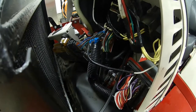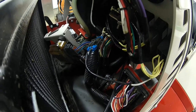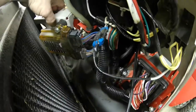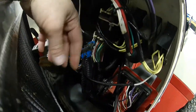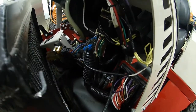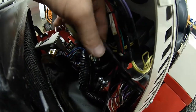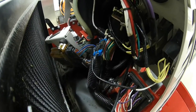I said this wasn't going to be a how-to video, but I did want to point out a few things to show you guys how nice it is working on the Ventrac. You just loosen up a couple bolts, remove the TCM panel, place it down there, and all these plugs are accessible back here. So anytime you buy an accessory — like the beacon kit or the horn switch — you just remove that, find your designated plug as directed, and that plug comes up to your switch panel.